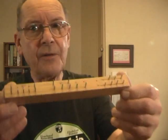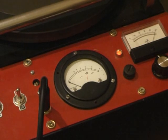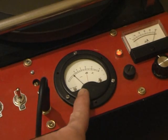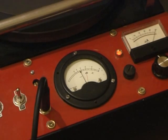What about the cutters in the cutting head? Actually they're not cutters — they're embossers, they don't cut. They're very simple: made out of 1.5 mm high-speed steel, just under three-quarters of an inch long, with an 84-degree cone ground on the top. They're easy to make and extremely cheap — all shown on the webpage. They should last quite a long time because high-speed steel is pretty hard and polycarbonate plastic is pretty soft. Another very important adjustment is the recording level, so we need to set that. I'll just kick the file in — this is a reasonable level, adjustable by this preset, and I've fixed it so it should be a good level for cutting.